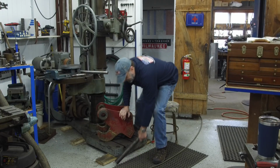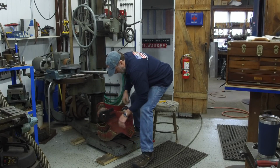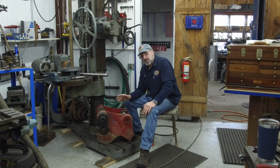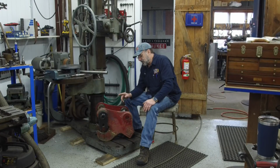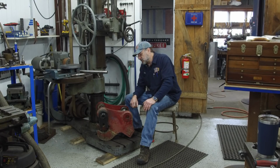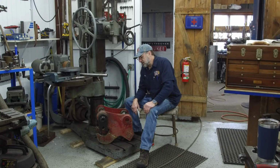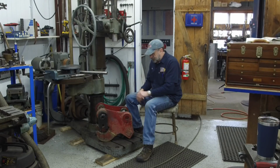What we have is a bore here, and this pin actually fits in here. It's kind of sloppy, so we're going to go ahead and make other bushings that are going to go in the end of the boom, and if we tighten this up here as well, then we've kind of made everything like brand new. Now we're going to bore these out and then make a hardened bushing, and the other bushings we're making are going to be hardened bushings as well. Now we can't do the crisscross grease groove that's going to be in some of the smaller bushings, but we can make adequate grease grooving in it for sufficient lubrication to get to that pin bore. All right, now we know what the project is.